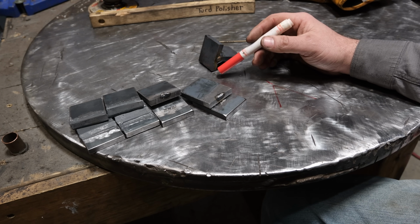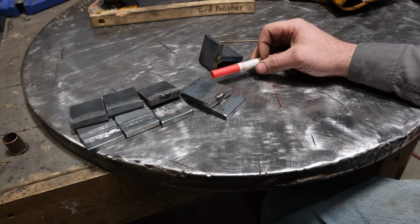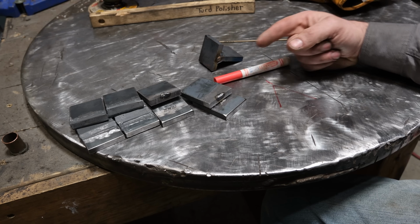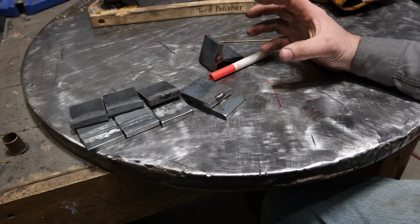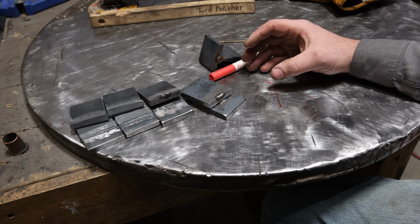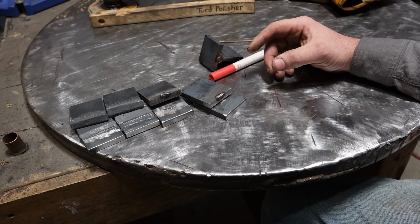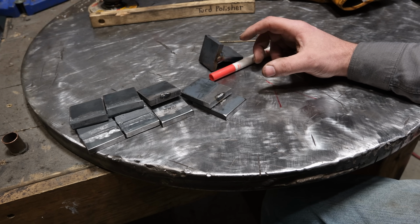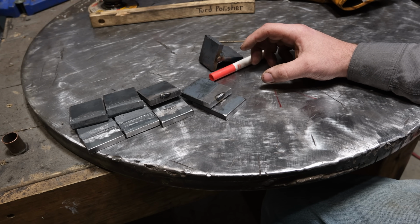So a heavy duty diesel motor, so you're talking something out of a garbage truck or a dump truck, at a shop, basically had spun a main bearing on it, and it wrecked the bearing cap and the block, and they didn't want to send the block out to be bored oversize to get bigger bearings in it to make it work. And they actually took new bearings, put them in there with JB Weld, bolted it together, let it sit overnight, and ran it.